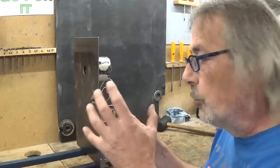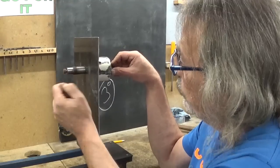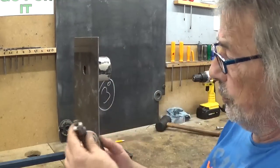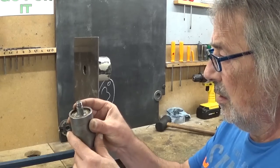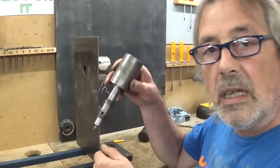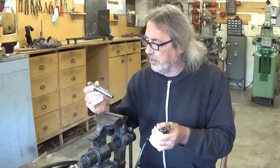To hold the part in place I want to weld up. What I would like to do — of course this thing comes in here and is held on with two set screws — what I would like to do is weld in this bolt here. It's a left-hand thread, it's a bit special. So weld it in and then make a center point. I suppose to do that it would be better if I disassemble the thing. I managed to get it out. The ideal way to weld this thing up is of course to use a welding rotator, but...